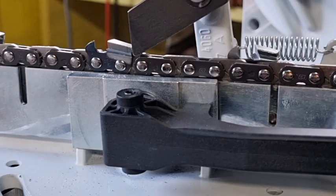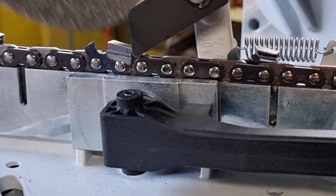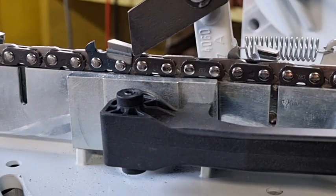You're wasting your time with the vernier because as I showed in those pictures, the back of the tooth is terrible — it's not a good way to measure something with such a rough finish. I typically use the grinding wheel as my reference to determine which tooth is high or low. If it's a short tooth the wheel spins freely; if it's a longer tooth it barely touches. Set it just touching on the high tooth, and you may need a further adjustment on the backstop as you proceed grinding. Just bear in mind that from brand new, these chains are not a high-tolerance piece of equipment.